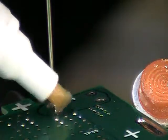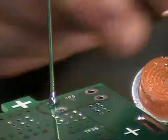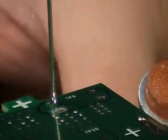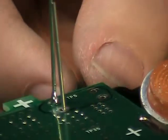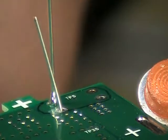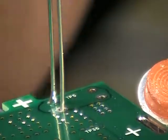We'll go ahead and make sure we flux the trace. We'll move the heat-sink for the next thermal fuse. We did test these for continuity to make sure they're working properly before we soldered, and we will test it again after we soldered to make sure that we did not activate the thermal fuse link.